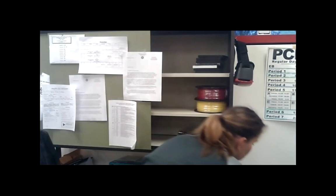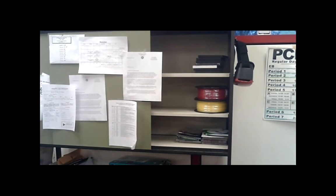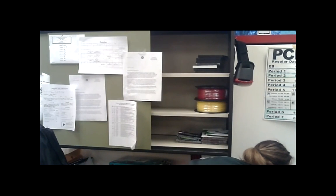Yep. Okay, awesome. And now we're going to grab our paper and have it folded in half. Then we're going to slide it between the nozzle and the build surface. That build surface is what says NWA3D. That's what's clipped down, because you can actually remove the build surface when you're done with your model to be able to pop them off. If you cannot get the paper underneath, that's totally fine. That just means it's a little bit too close, and we're going to adjust that here in a second. You can push down on the build plate with two fingers and then push the paper underneath there until it goes. And then you'll get it under there.